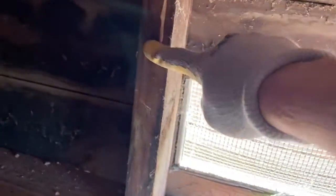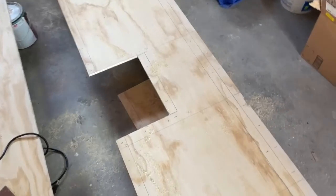The additional blocking wouldn't be necessary anymore because I'm going to cut it here and here, and there'll be a block here so you keep a continuous perimeter of seam nails going up and around the vent opening. So far it's looking good and hopefully we'll get this thing in soon.